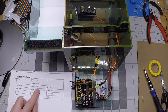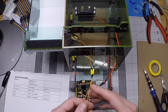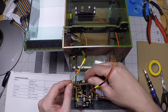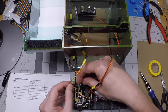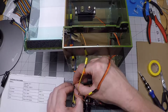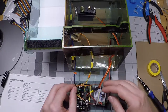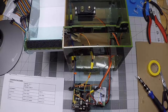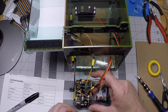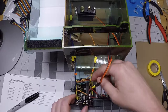The coin sensor calls for either of the leads to go to Uno pin 3 — it doesn't matter which one. Looking inside the crow box I can see which pair of wires goes to the coin sensor. One of these needs to connect to Uno pin 3, which is between the two existing connections we've made. You may need to square off the existing connectors to make room. The other coin sensor wire goes to Uno ground — there are two GND pins on this header row and we'll use the second one.